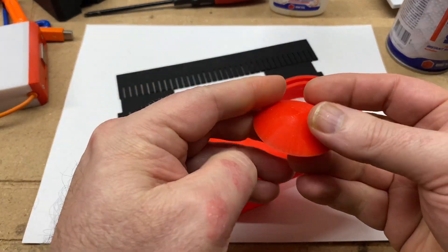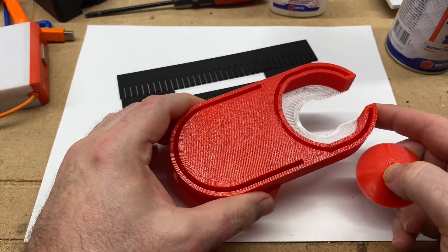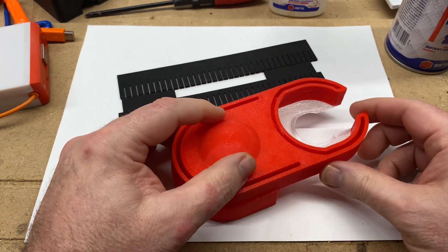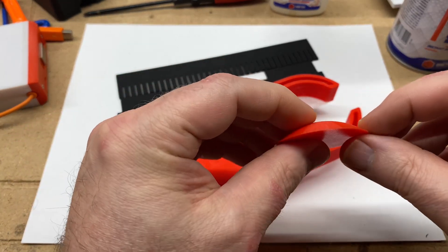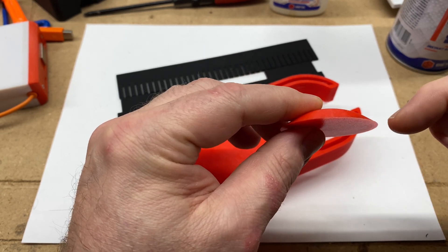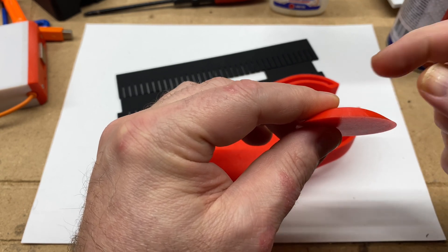This thing can work on any version of the floating dust shoe that I have made — you simply print it and glue it on, presumably with CA glue. You can print it in any layer height you like, but if you print it at a tall layer height like 0.3 or something, you're going to have more of those Aztec stair steps on it.